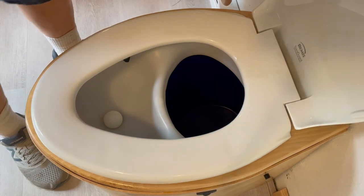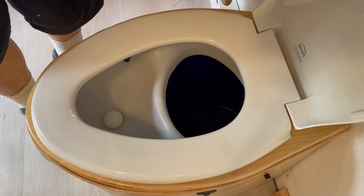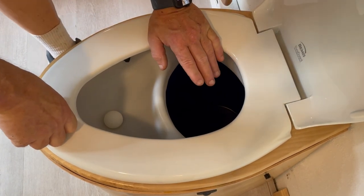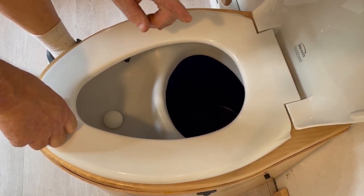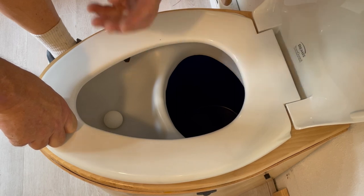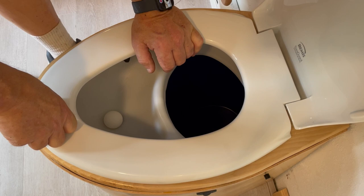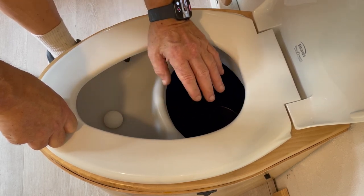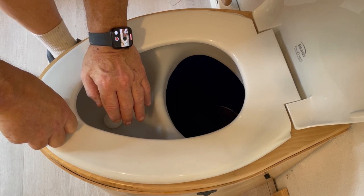And the reason for that is that solid waste smells when you're doing it because it's gas from the human body. But afterwards, it really doesn't smell that much. What really smells, gives that bathroom or toilet smell, is the urine because it gives off an ammonia compound. And particularly after it starts to get rancid. So collecting it separately from the solid waste allows the waste bacteria to work and the urine to be contained.